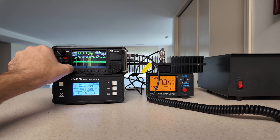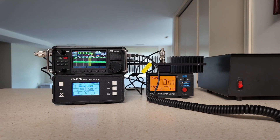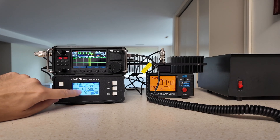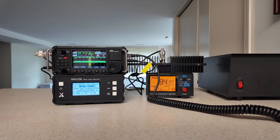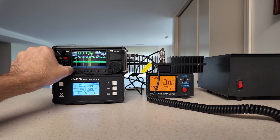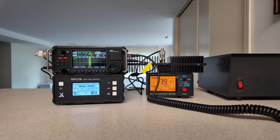Let me see if I turn this back up again — this did something weird when I was playing with it before. Now it's switching to auto FT817 mode repeatedly. That's because the amplifier does have a way to key from the FT817 — I've shown that in a previous video, I'll link it up there. So with extra power it does some crazy things, but with the right amount of drive — five watts — it's steady at 78 watts out. Fantastic.